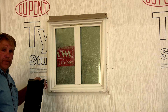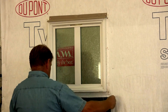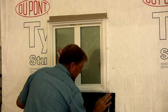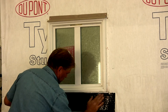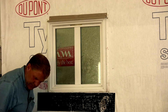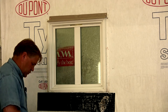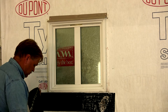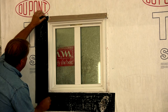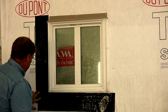This is the peel-and-stick or Fortiflash product. It's a bituthene product with a peel-off backing on it. What we're going to do is take that and apply it directly on the window flange to the Tyvek, which completely seals that. Then we take the two sides, making sure that the product is completely over the window flange — the nailing flange — and completely out onto the Tyvek area.